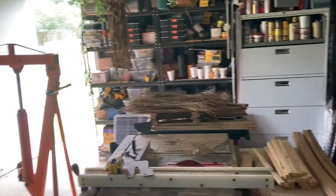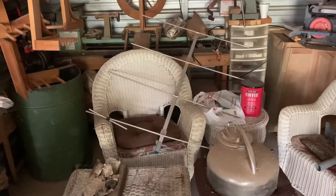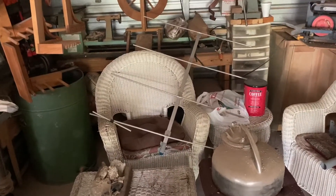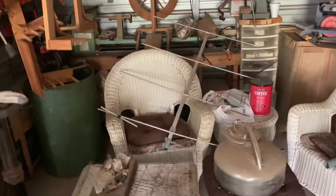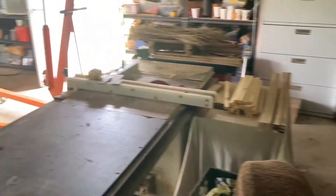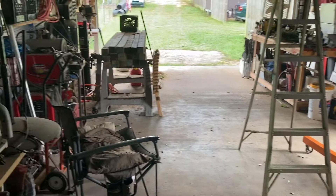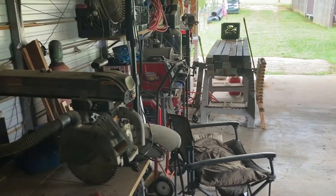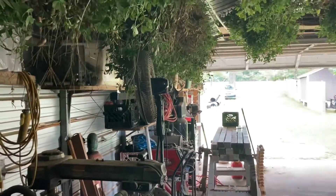There's a two-meter Yagi antenna that we're putting together — it'll be ready for springtime. I've got an omni-directional antenna up now for our two-meter rig, but being able to point right at a large tower that's about 40 to 50 miles away will allow us to use that repeater whenever we want.